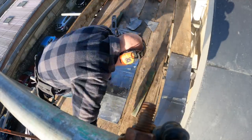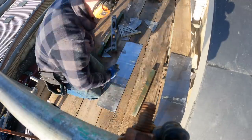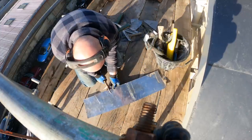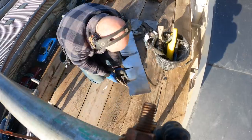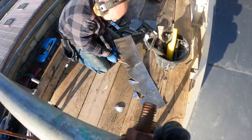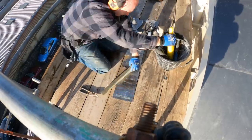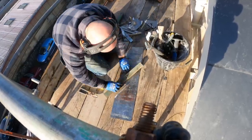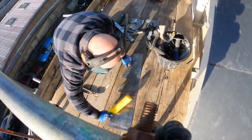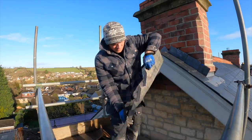We've got our aprons in, we've got our soakers in, and now we're on to flashing. At this point slates are all the way to the ridge, and this is now going to be chased into the brickwork to give our vertical section to our leadwork. I'm just replicating everything Lewis showed me in a previous video — if you want more detail, I'll link to it at the end. Essentially this is a one-piece step flashing coming down the side on each stack, so we've got eight of these to do in total. You can do individual step flashings, but this gives a nice traditional look that seems to match other old properties around here.